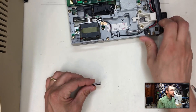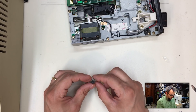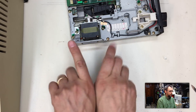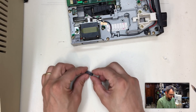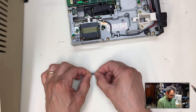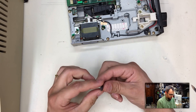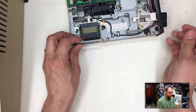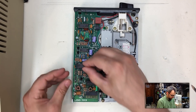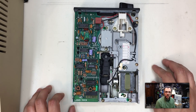The chip isn't going in very well. Here's a little trick for inserting chips into boards: roll the pins on a flat surface. Chips often come with the pins slightly splayed out, so if you just roll the chip slightly on the table, it'll pull those pins back inward so that it goes in like a champ.